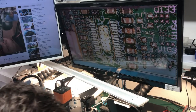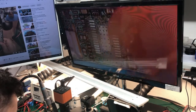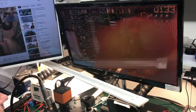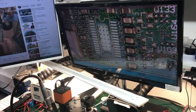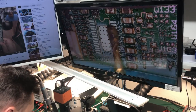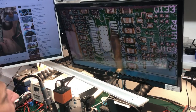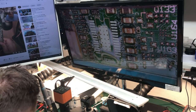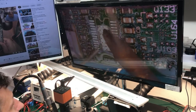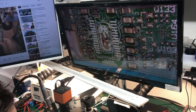Okay, let's clean with alcohol. Put this on — there's flux. Just a little bit, not too much. A little bit of solder blob on the pad over here, just to make sure. Just a tiny bit — that's all.